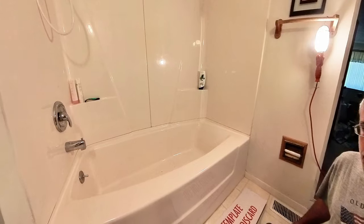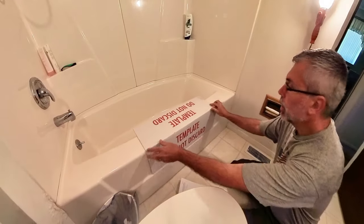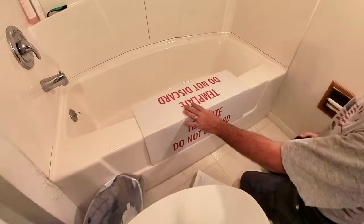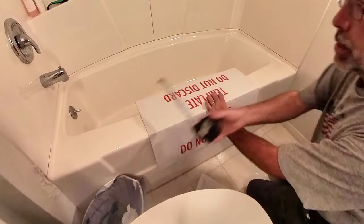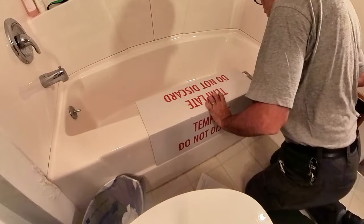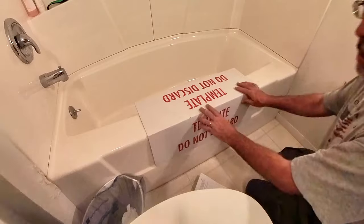In order to make sure that your tub can handle this kit that I'm using, basically it's the size of this template where we're going to cut. And so you can see kind of where that will be. You kind of place it where you want to. I'll try to go towards the middle there. And this top rail can't be any more than 6 inches at the widest point. The bottom can't be any more than 7.5 inches. So we are definitely able to use this mod, this kit. And so we're going to go ahead and get started here.